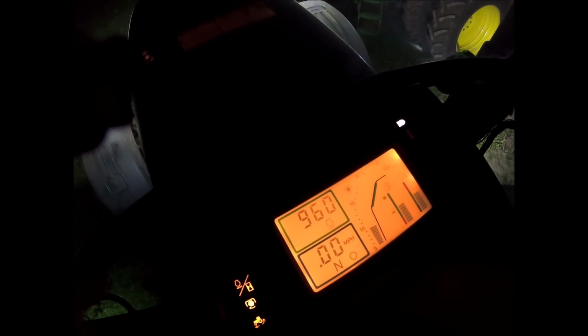So what I simply did was start the grain cart real slow, and I don't have the 4020 back yet. I think they're waiting on parts right now, but the hydraulic pump is back in, and I think they're just waiting on brake pads. Starting up the 7600 with the grain auger, going to rev it up to, I aim between 1100 and 1200 RPM, because this stuff does seem like it's got a little bit of moisture to it. I don't think it's so much the corn as it is the actual plants themselves. So really not trying to overload.